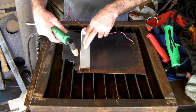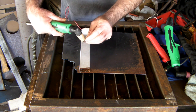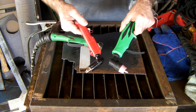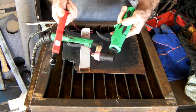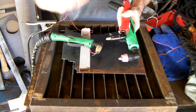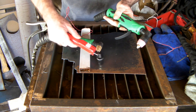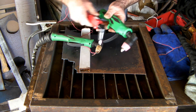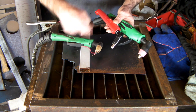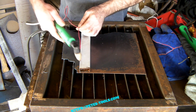I've been doing this for about eight years and it works fine. So now what we do — just this little piece of wire — hook it back over your nozzle. This will work on any of the other generic torches as well, like the SG51 or the AG60 — put that wire on and it'll give you pilot arc. But I wouldn't use it all the time, just to start. As soon as you make contact and it starts cutting, the current goes straight through your cutting tip again — not through the wire.